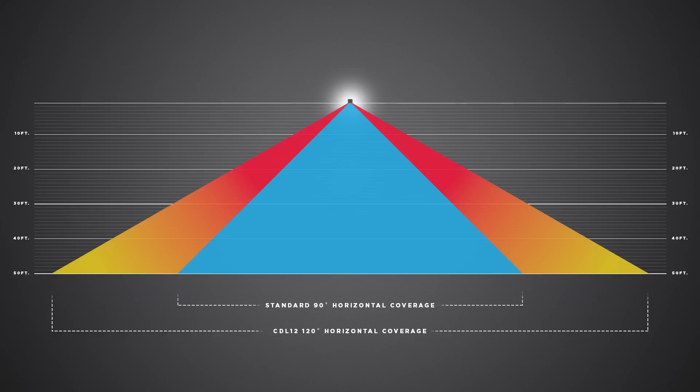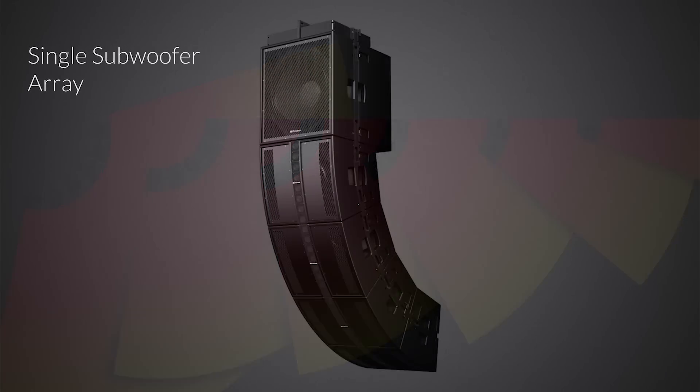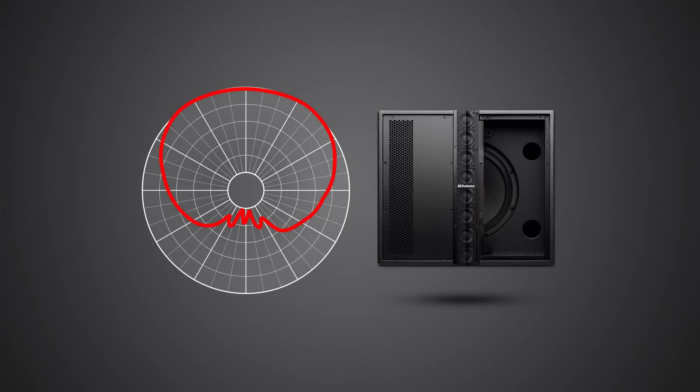With this system, we have 120 degrees in the horizontal and 20 degrees in the vertical. If you're a small church or a small band, you could end up with one box. If you needed to add another box for a little bit more level or coverage, you could add two boxes and now you have 40 degrees. You can go with this system all the way up to six boxes. So if you were flying in a big room hitting a balcony all the way to the front edge of a stage, this is scalable. The energy comes right out of the center of this box, dissipates up towards the top, the bottom, and side to side. When you put two boxes together, that comes out of the center of both boxes — so the intelligibility and gain before feedback just has a lot of benefits, and it's extremely scalable and cost-effective for people.